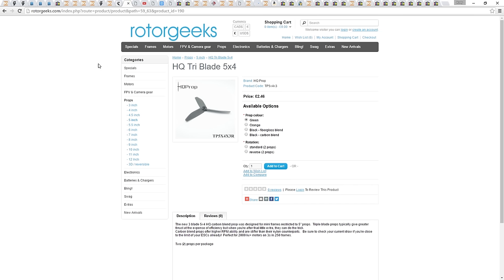Despite what you might think, the pros mostly use three-leaf and four-leaf props. I also have experience with three-leaf props with my Flying 3D X6 quadcopter. I discovered that three-leaf props give extremely smooth flying at the compromise of flight time. The extra blade creates a lot more drag, thus putting more strain on the motors and ESCs, which in turn drains the battery quicker. You will be surprised to hear that our flight times will be about 3 to 4 minutes with this setup, and this is pretty standard for these race spec quads. The motto is live fast and die extremely young in a pile of carbon.